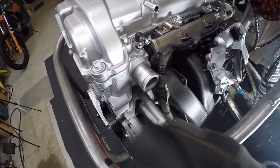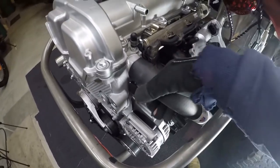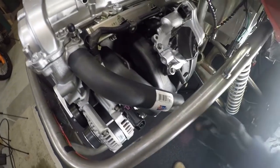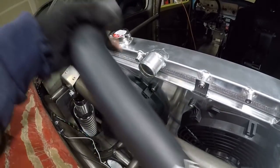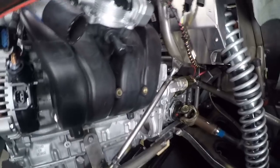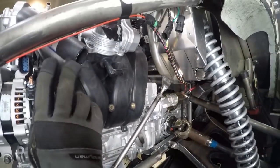This is the outlet coming out of the engine. I took my inch-and-a-quarter hose and sized it up, tried it on both ways, just kind of looked it over to see what I had to work with. I decided I would go with this end — I liked the bend it gave me. I decided where to cut it and cut the radiator hose right there. I did the same thing on the other side with the inch-and-a-half piece. Then I put it on the radiator, roughly where I want it to be, telling myself I need to make a steel pipe that will run from here and connect to the rubber hose on the other end. That gives you something to work from — you know you've got to go from here to there, then you can pick your path.